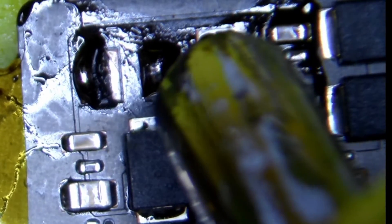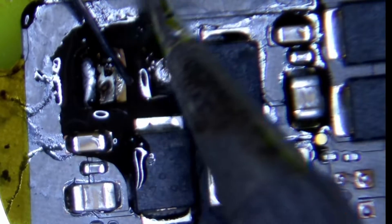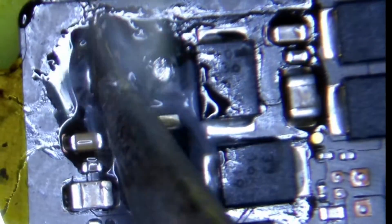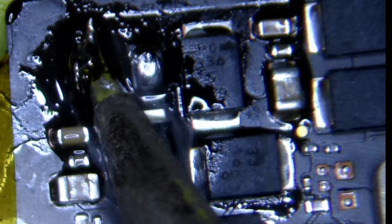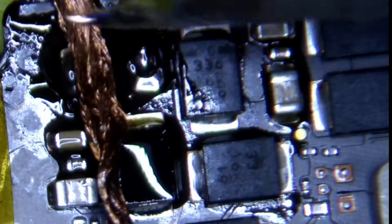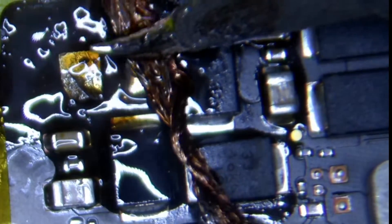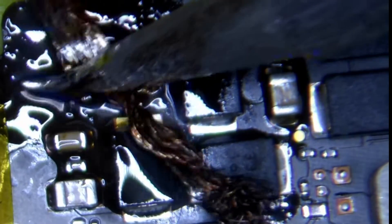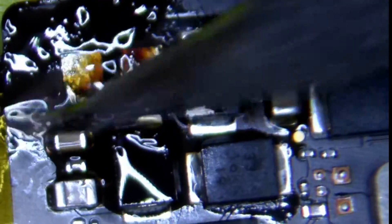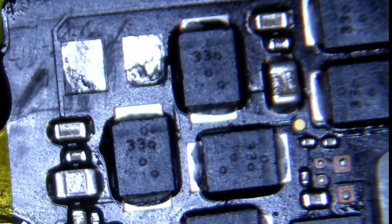The thing about any type of burn situation — especially if it's a little melted — is that it can melt to the actual pad itself. So we also have to make sure that the pad is totally clean, so it's going to make a nice connectivity for when we replace our cap here. We can add a little bit of solder to help remove it and use a hot iron — it's going to make it much easier and loosen it up. We're just going to keep removing it, make sure it's fine, because it needs to make good contact. Using a little copper wire with some flux is going to do a good job to help remove the rest of it off, because that burn is nasty. You want to make sure you get every little piece of it off. Now you can see it's clean — we can clean it with some alcohol, brush it clean, then put solder on our cap there to make sure it's going to have a nice connection.